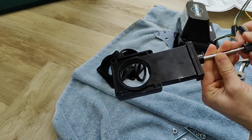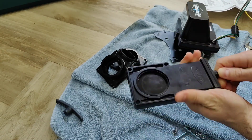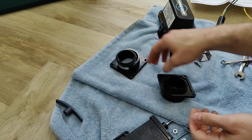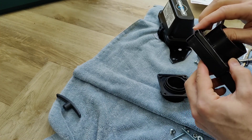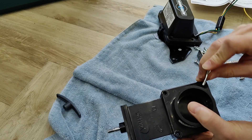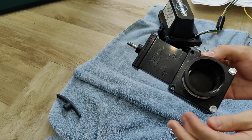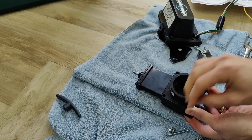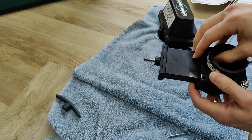We're going to take our gate valve, open it up, and we need to remove this handle from it — just twist off the handle right there. It's about the only thing we're not going to need. We're going to take our slip sockets and put these rubber gaskets on both of them. That's just going to keep the water from trying to escape outside of the gasket as it's flowing through the valve. We're going to put each of these on the valve, one side and the other, and then bolt it to the valve body. We'll only put them on the bottom because we're going to need those top holes on the valve body for the next step. We'll just lightly put these on for the moment to keep the gasket from moving around, because if it moves too much it could slide off and become damaged if we tighten it without realizing it.